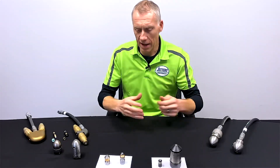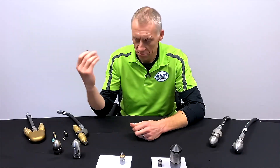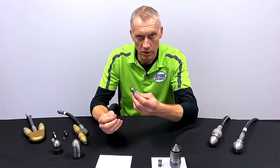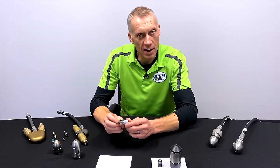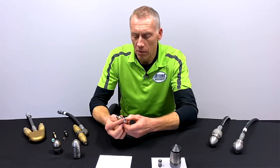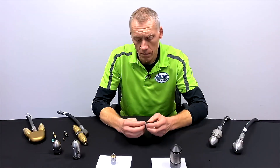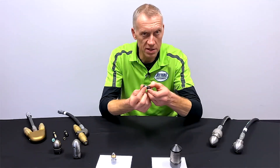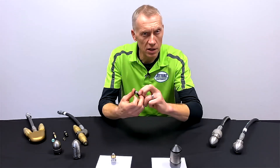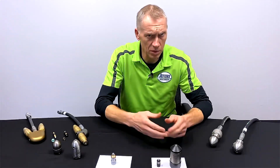Taking it from the top: the inexpensive pressure-wash-industry spinner leaks a lot and doesn't have much impact — I just don't recommend it. A more basic high-speed spinner — these are included with every one of our Eagle or Brute jetters — is nice for soft, sloppy grease, septic sludge, and stuff like that. It's not going to have a lot of cutting power but it's pretty inexpensive for what it can do. Moving on, the controlled speed spinner — we use these a lot for restaurant grease in smaller lines. More precision-made, slower rotation, it goes in and peels out hardened grease. Available in bigger sizes too.